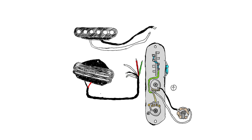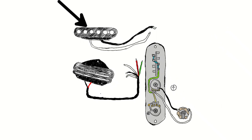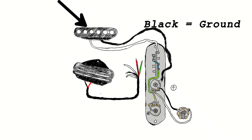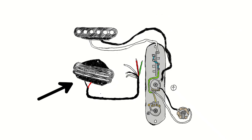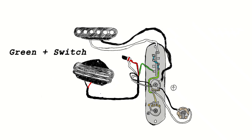First I'm going to give you a quick rundown on what the basic wiring on a Telecaster looks like. It's pretty simple. I've got two 500k pots. The neck is a single coil — it runs to the first lug, or lug A. On this switch we'll label the lugs as follows: A1, A2, A3, B1, B2, B3. The white wire from the neck pickup goes on lug A, the black is grounded to the volume pot. On the humbucker, you tape off the red and white, run the black and the silver to the ground, then run the green to lug B.